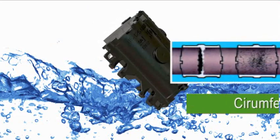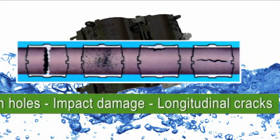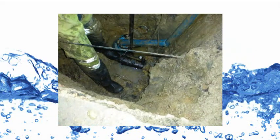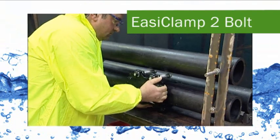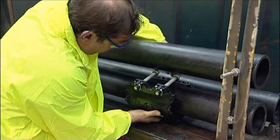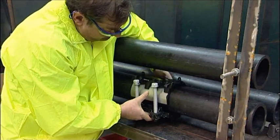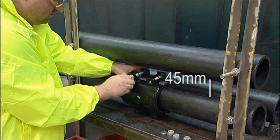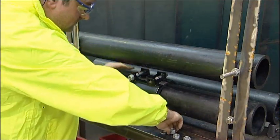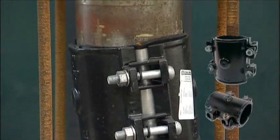Job done. Easy Clamp works on many common problems: circumferential breaks, corrosion holes, impact damage, longitudinal cracks, and it can even cope with modest pipe offset situations. For service pipes or cables in close proximity, the hinged Easy Clamp with no loose components can even be quickly installed on pipes where the minimum gap is 55 millimeters between services. In less common circumstances where services are closer with a gap as small as 45 millimeters minimum, the 4-bolt Easy Clamp can be a useful alternative.